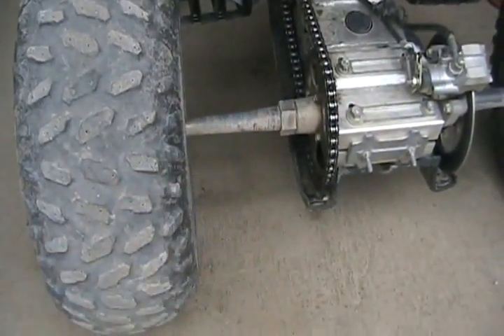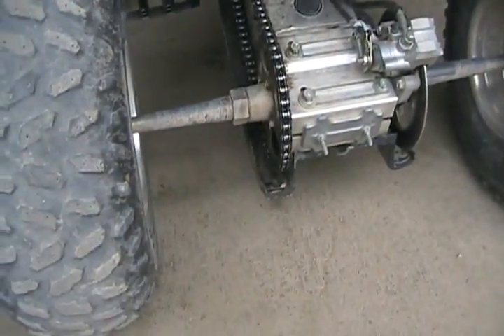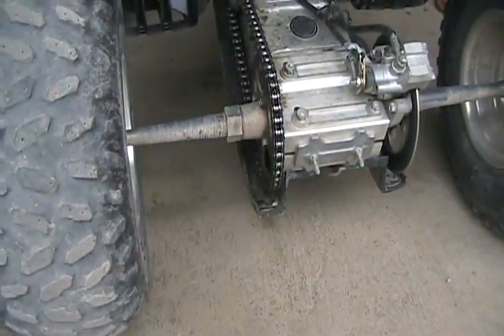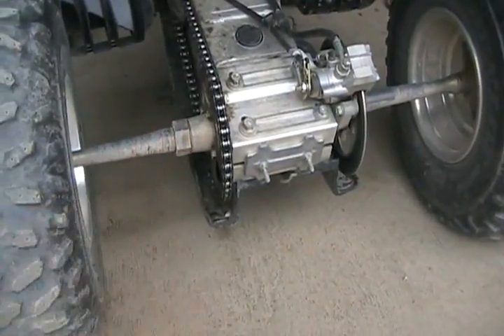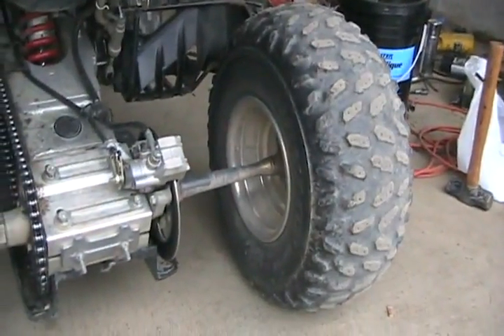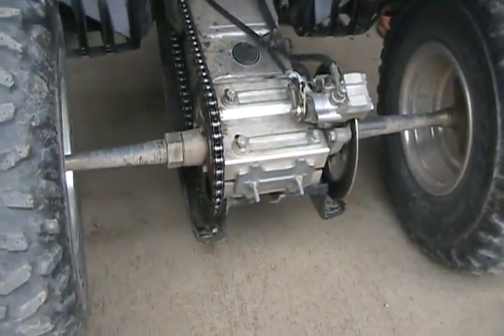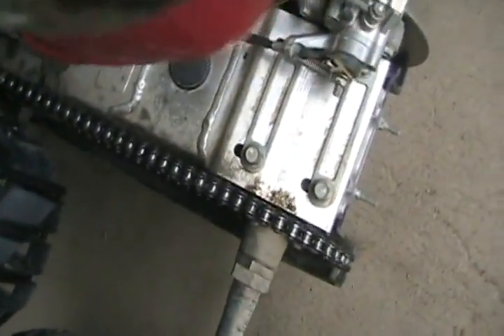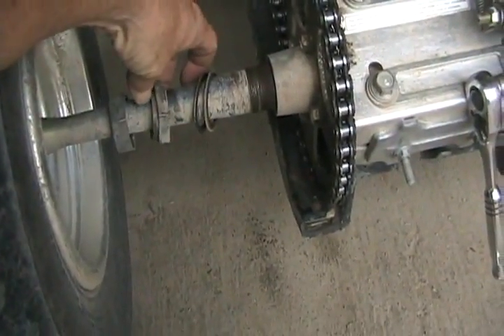The very first thing to do is to try to crack the locking nuts that hold the drive hub on for the sprocket. Leave the machine on the ground in gear and get a pipe wrench or a big wrench - whatever you've got. A big set of channel locks. Once you get all that tight stuff loosened, then you can think about doing other parts. You want everything to give you traction or friction so that you can turn those without the wheels spinning in the air in case you had it jacked up. I have the right size wrench - my big bulldozer set, inch and seven-eighths. Just get those two off right now.